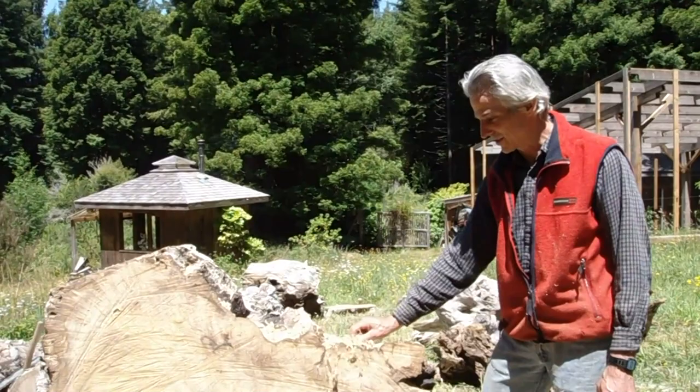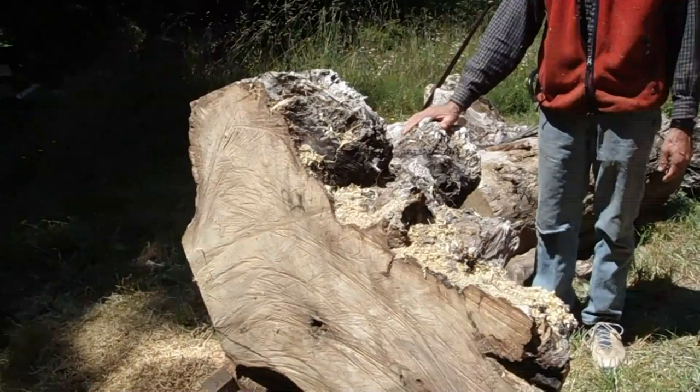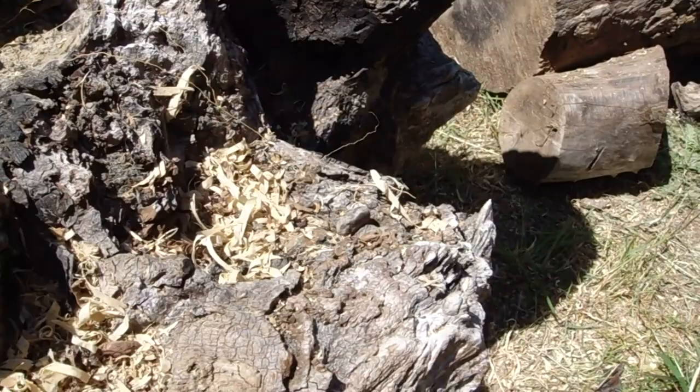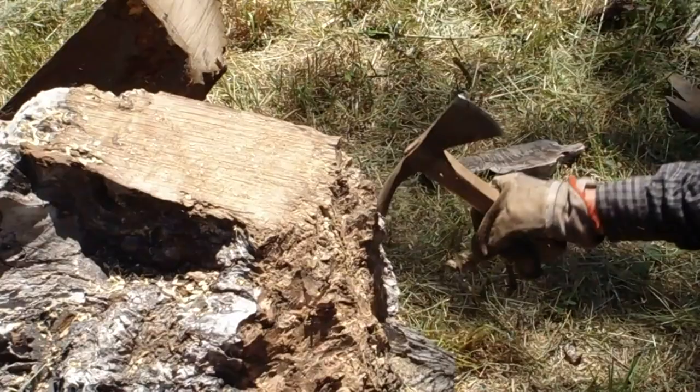So you get it down to about a ton? I'll get it down to probably about 500 pounds. Right now it's about 1,500 pounds, so I don't want to move it around. All of this will form the legs to the piece. There's a lot of sand and rocks in this, so I have to take an axe and an adze and work a lot of this off before I can carve on it at all, because it just immediately dulls the chain. If you hit the chain with that, the whole chain's dull immediately — sand encrusted — it'll totally dull my chainsaw. It'll take probably the better part of a day just to remove the outside of this so that I can even work.